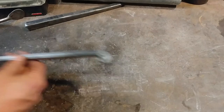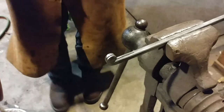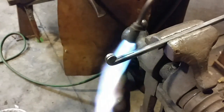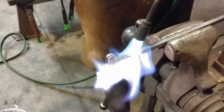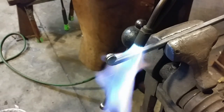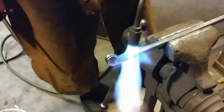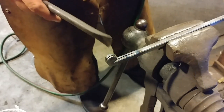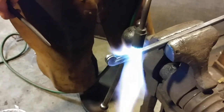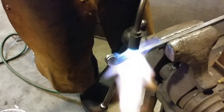So let's get to it. Okay everyone, here we are at the vise. As I've said in previous videos, I'm the type of guy that likes to take the path of least resistance when it comes to doing my ironwork. So instead of sticking this back in the forge, I'm just going to use the torch to heat up the area that I need to move, and nothing else. I need these arms to stay straight, and I just need right where the end of the cut is to actually be pried apart and open up. So that's the only part of this bar I'm going to heat up.